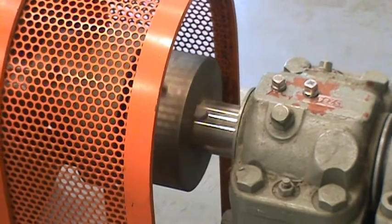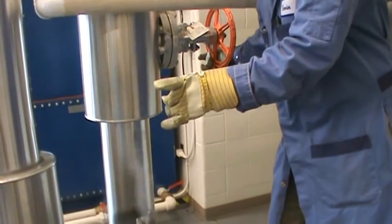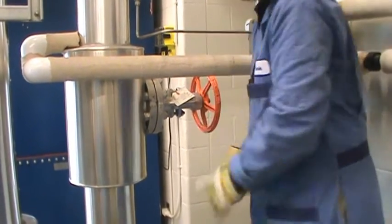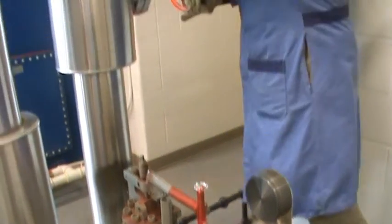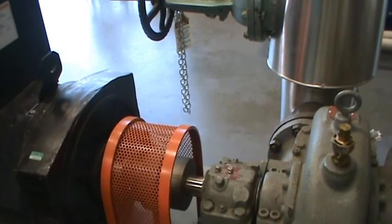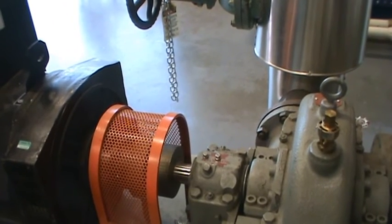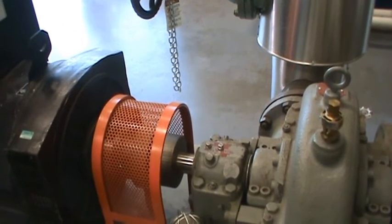The turbine is slowly slowing down — we just wait a few more moments until it stops. Now it's pretty much stopped. I'm going to close the steam valve to the turbine and reset the over-speed trip by pulling it up. Usually when the turbine is cold we have to run it slowly for 15 minutes before putting it online, but today the turbine is already warm, so I can slowly open the steam valve again.